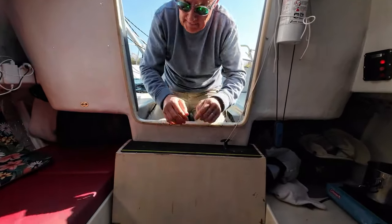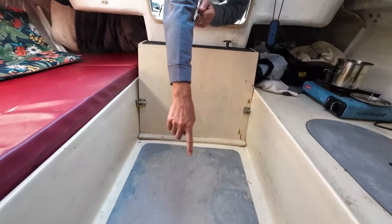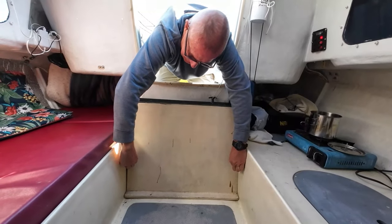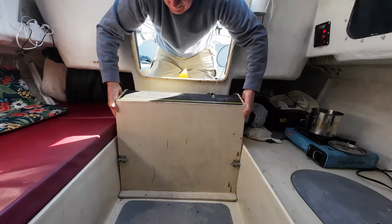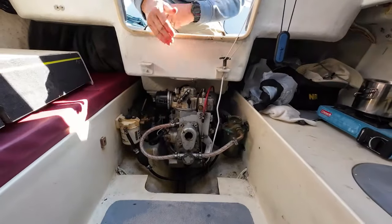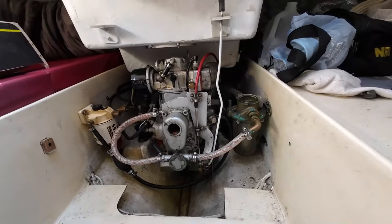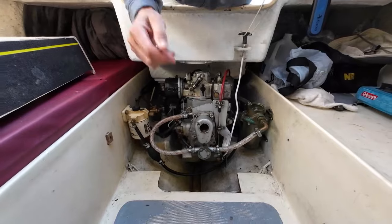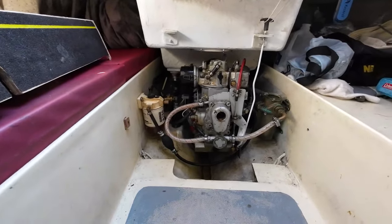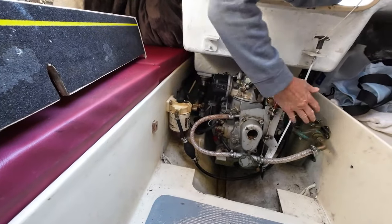You have an engine. Yes, there was a huge fiberglass step that came out to about here — seemed ridiculously big for such a small boat, not really doing anything except providing huge steps. So I made this little box here. Here we are — the massive power plant: a single-cylinder BMW engine. It's tiny. And is it reliable? Touch wood, yes, very reliable indeed. There's just a little water pump on the front here — I keep a careful eye on the rubber impeller. You can do absolutely everything right from here — the oil filter, oil dipstick. Everything is well placed. There's also an access hatch on the outside so you can get to the top.